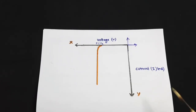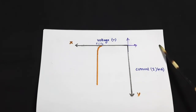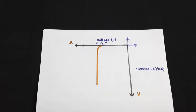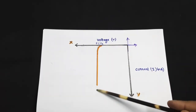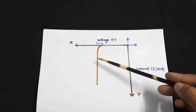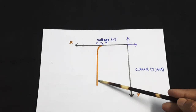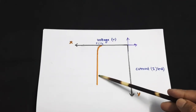You might think: what if the Zener diode is forward biased? You have the permission to do it that way also — you will get the typical diode characteristics of a semiconductor diode when the Zener is forward biased. But the interesting point of the Zener diode is in the reverse bias. You can interpret that this steady voltage it maintains across the junction will make it useful as a voltage regulator in various situations.